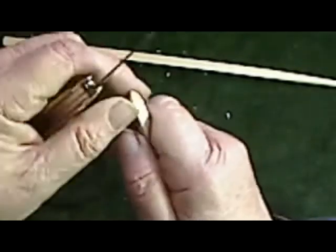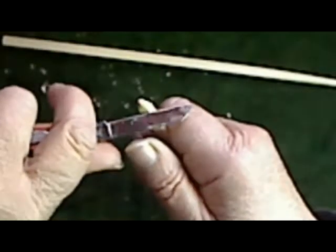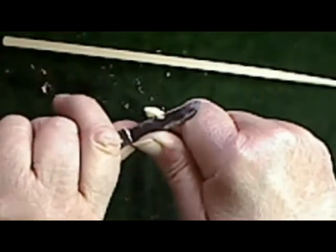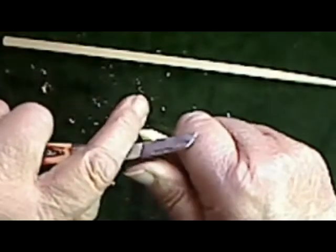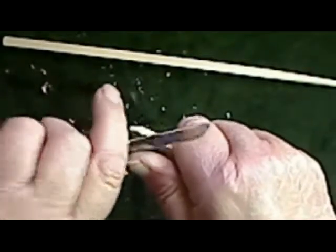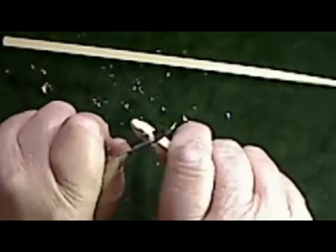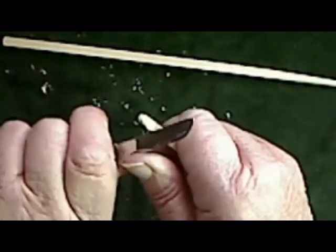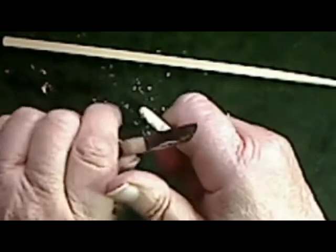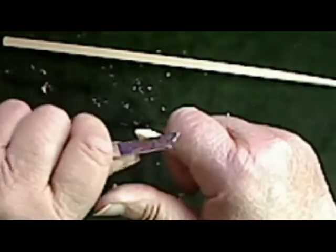Then I'll come up and make my little smile, and back cut. Make it a bigger smile, and back cut. You want to keep deepening your back cut — you do not want the cut you're making towards it to be deeper than the back cut that's there, or you'll split your wood.